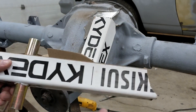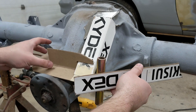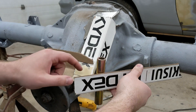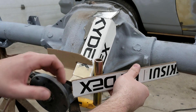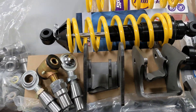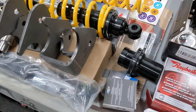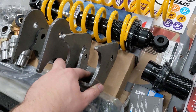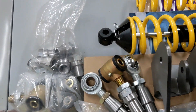This is basically going to be my torque arm mount with a heim on the top and a heim on the bottom. I'll probably box this in somewhere, but I'll have lots of area to weld and give myself a cheap low-buck, pretty easy torque arm mount to run with a Beretta. I also picked up a whole bunch of stuff on Black Friday from Speedway and Barnes four-wheel drive to make the rear suspension work — lower control arm mounts, upper coilover mounts, lower control arms, and some bar for it. That will be in another episode coming up.